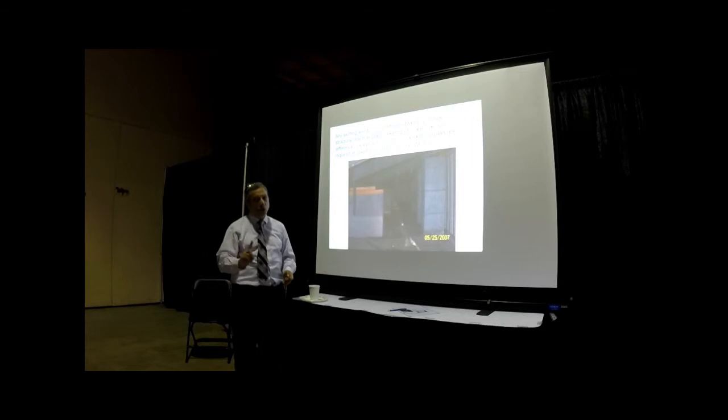Just be careful now, it's not only at the chassis. I saw many houses that only have the support at the chassis, and that's not according to the manufacturer, neither is it according to HUD code. You have to have support at the very edge.